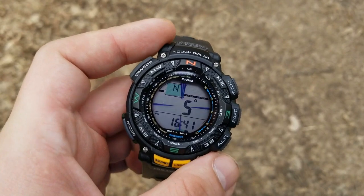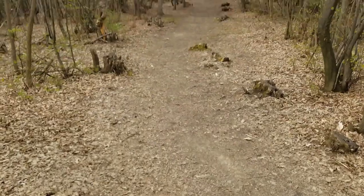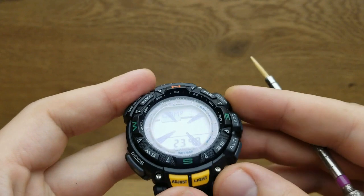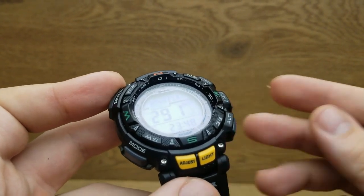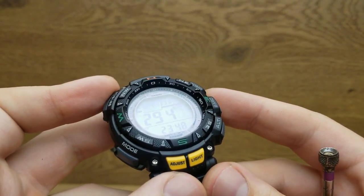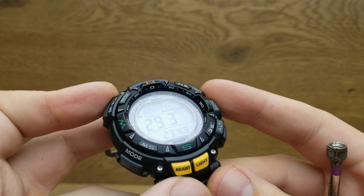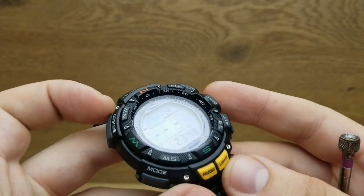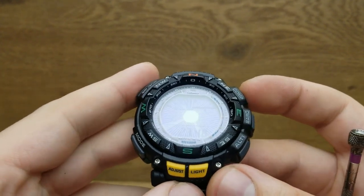The bearing memory direction angle flashes for about 1 second as it is stored in the bearing memory. After that, the bearing memory screen, which shows the bearing memory directional angle, will appear, and the 20-second directional reading operation will start. During the first 20 seconds after you display the bearing memory screen, while the bearing memory screen is on the display, the direction stored in the memory is indicated by the bearing memory pointer.